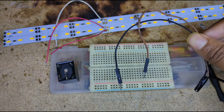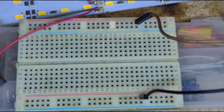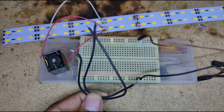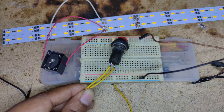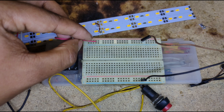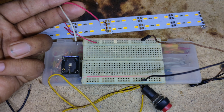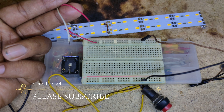The brown pin is positive and the black pin is negative from the power supply, which can control up to 15 volts load. I'm connecting the voltage source to a breadboard — the positive side brown pin connects to the breadboard's positive rail, and the negative pin connects to the breadboard's negative rail. A push switch with soldered wire is needed, and the wire fits the negative side of the source.